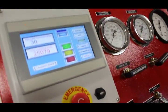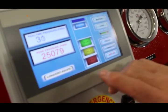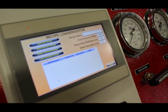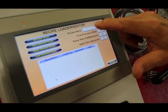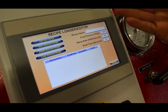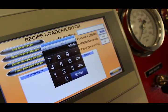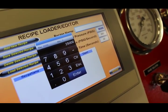This is the PLC home page. To program our test pressure we first load our recipe on the recipe page. Here you can enter the recipe name by touching the screen. This is the final pressure set point — I push that and enter the final test pressure at 25,000 psi.